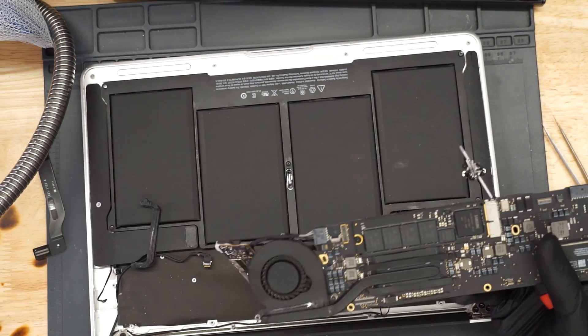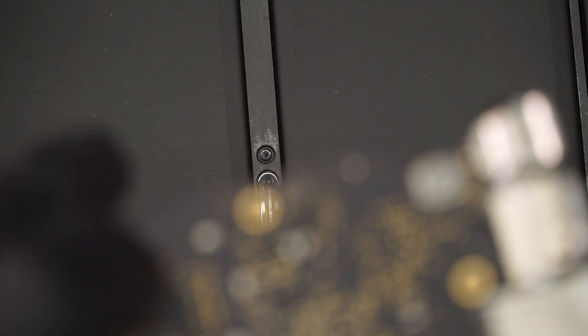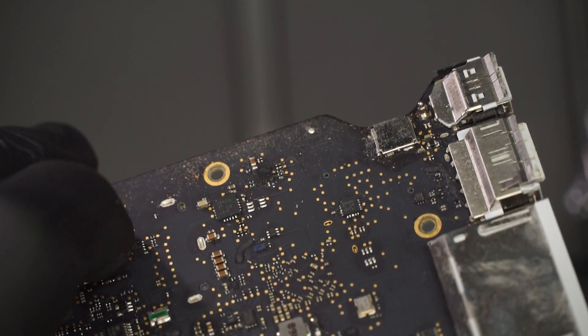For no backlight, that often means that we have corrosion on the DCN, which on this machine is totally clean, or on the LED driver, which is totally clean. So I think it might just have to do with the shorted capacitor. I'm going to show you how that shorted capacitor is causing this not to work on the schematic and the board view.